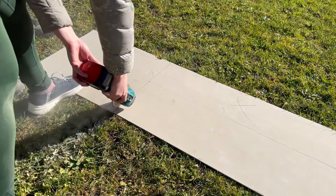Once that was finally done, it was time to cut some new cement sheeting for around the shower base. This is going to be installed where I removed the old rotten cement sheeting, so I measured and cut down to size what I needed and then screwed that into the studs in the house. Because this was cement sheeting going to be tiled, I needed to countersink all of the screws — I drilled in first to get an indent and then installed the screws flush with the front of the cement sheet panels.